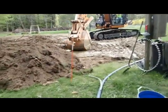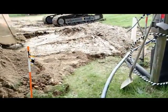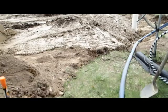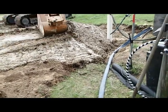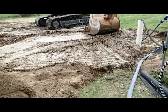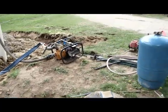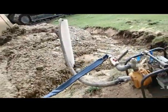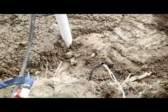What I'm having Greg do now is put all that wet spoil right on top of the hole and let it dry out for a few days, because what's below it is pretty wet anyway. This will just have to sit here and dry — might take a week. The other thing I'm trying to do is develop the well as soon as we've backfilled enough to be able to get at it.